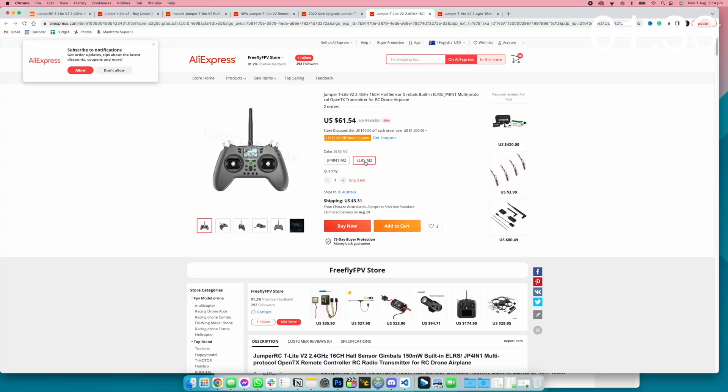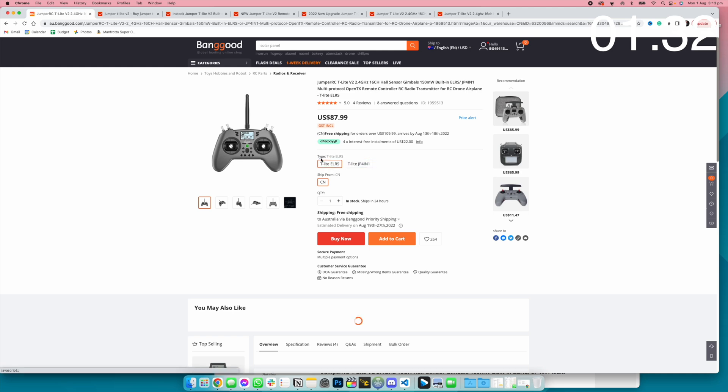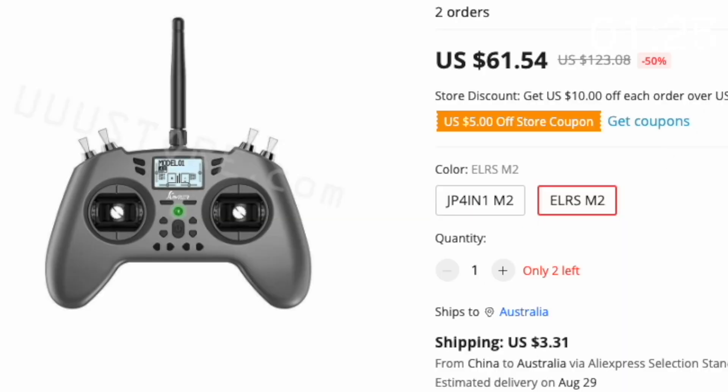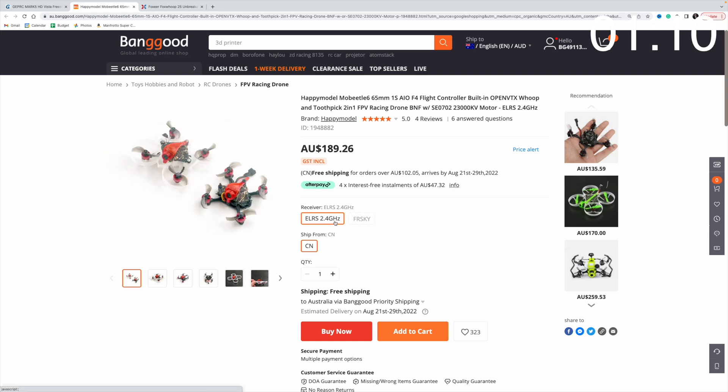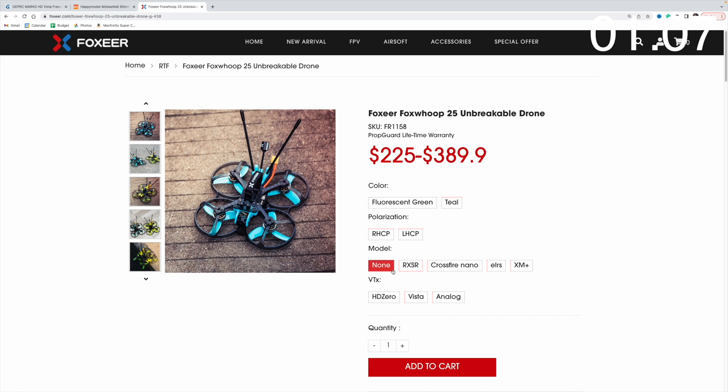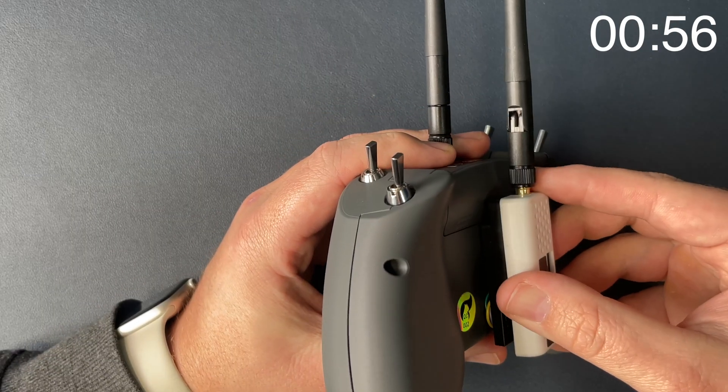So far it's stacking up to be a pretty compelling prospect for $60, but this is where I found some issues with the pricing. On AliExpress it ranged from $60 to $75; on Banggood it was $88. If you're a beginner you're probably wondering whether to choose the JP4-1 or the ExpressLRS version. In my mind, the multi-protocol JP4-1 is useless if you're new to FPV. Most bind-and-fly drones come with an ExpressLRS option, and you'll get more range and better control with ExpressLRS than with FrSky. Unless you already have drones running FrSky, start with ExpressLRS — and you'll still get the module bay if you eventually want to switch to Crossfire, Tracer, or Ghost.